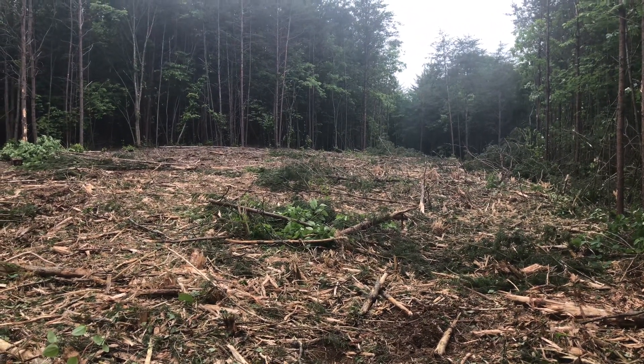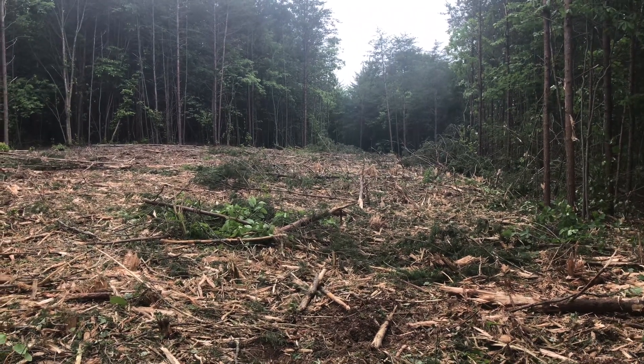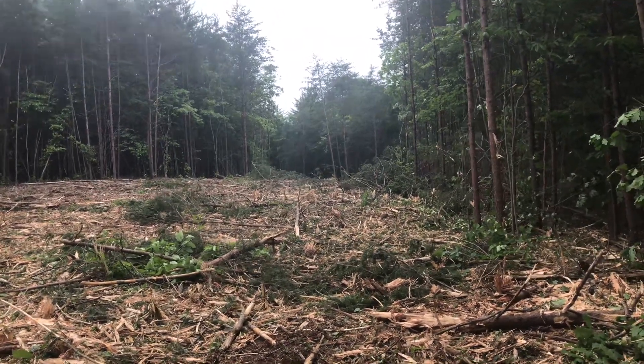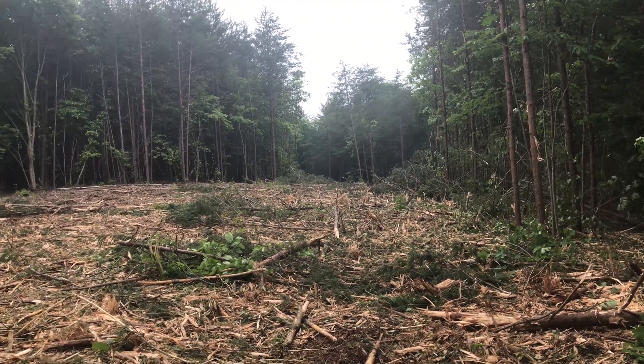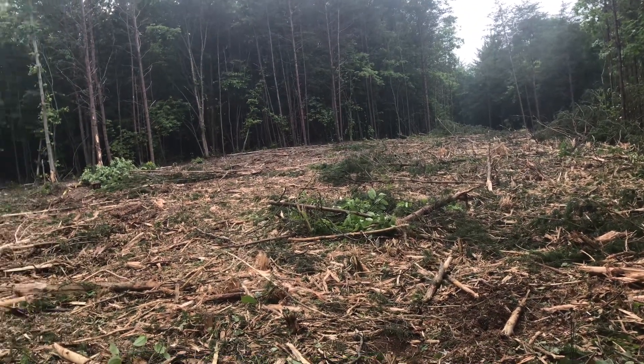This space has to be clear enough for a fifth wheel to pull a container in, and we will have some elevation challenges. We're going to get all the topsoil off and start bringing soil down from the top — we might take a big bump out of the top of the hill and bring it down here for fill. There's 25 acres, so we'll find enough fill, but we have limitations on how much we can haul and the access points.